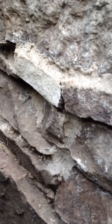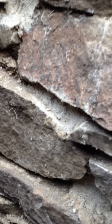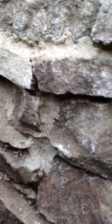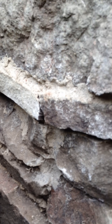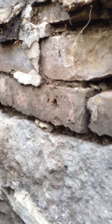It's not a replacement — it's just filling in some of the major gaps. It's primarily for rodent entry, but it'll also help with water. Once I'm done with this I'll put in a platon membrane, which is a dimpled drain plastic sheeting that just sits in front of the wall and keeps moisture out.